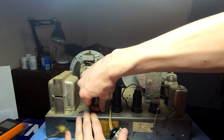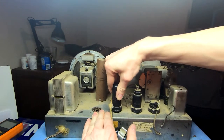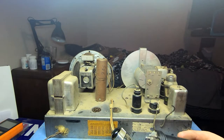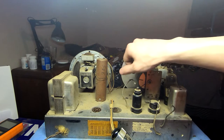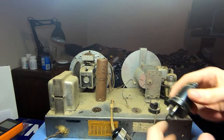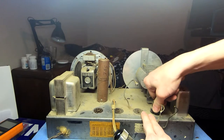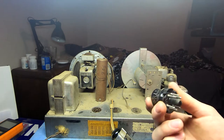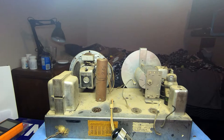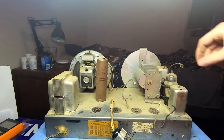The first thing I'm going to do is depopulate the chassis and give it a much-needed cleaning. There are some wonderful spiders underneath the 6F6. Then I might do something I don't normally do — I'll break out my variac and very carefully bring it up to see if we have any action on it. I'll put my watt meter in circuit to make absolutely certain we don't have any sudden spikes in current. The 6H6 is rattling a little bit, but that doesn't always mean it's toast — and I have a whole bunch of spare 6H6s, so not a big deal.